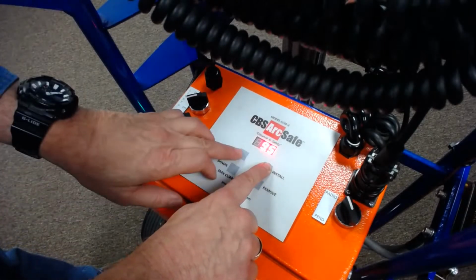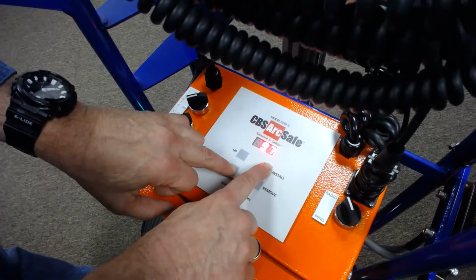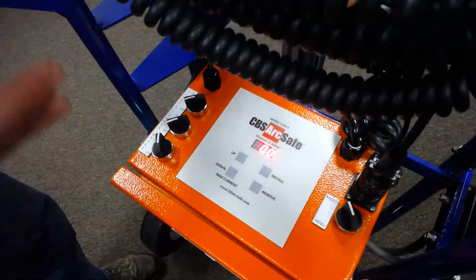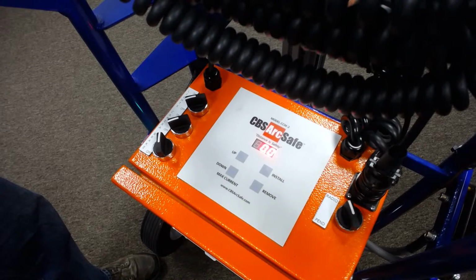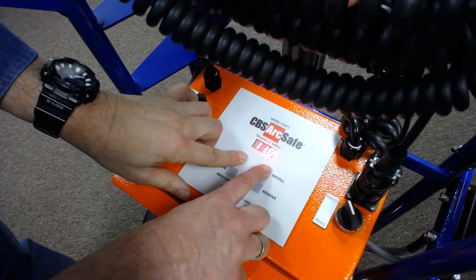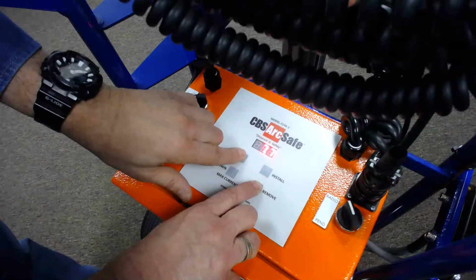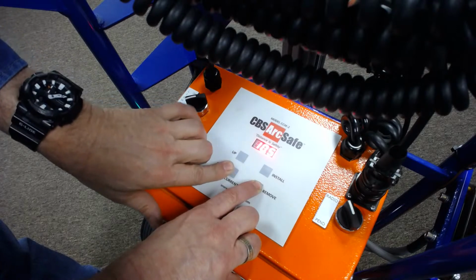And so we're able to quickly change our install and remove settings because the RRS-1 is not a PLC-based system. It's very easy to change these settings. So if you've got a breaker like this, or say a General Electric power vac, if it's a 1200 or 2000 amp breaker, we can set the RRS-1 up. If I was dealing with the GE power vacs, I know that if I set it at 12.5 for install and 10.5 for remove, I can do 99% of the GE power vacs that are out there that are 1200 and 2000 amp breakers.